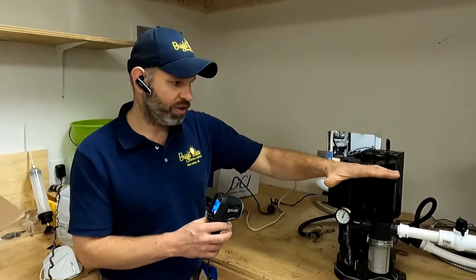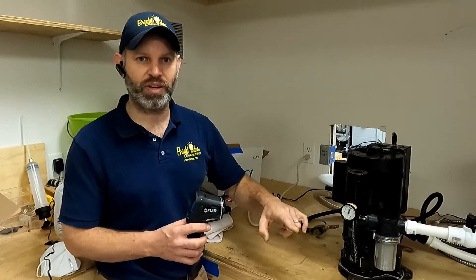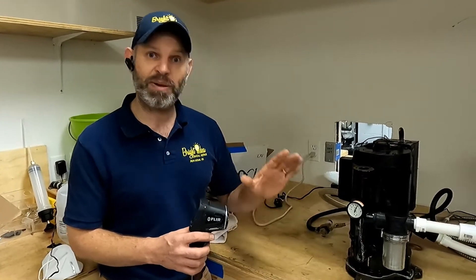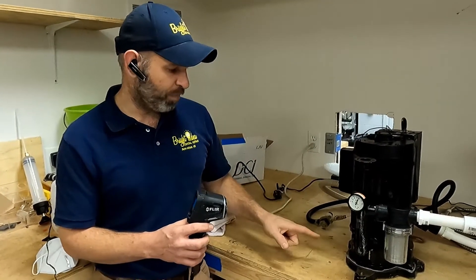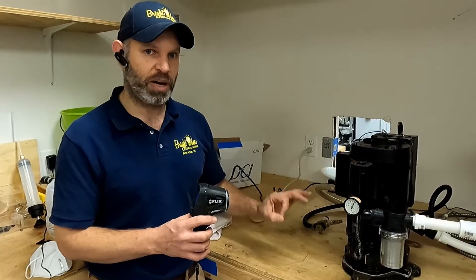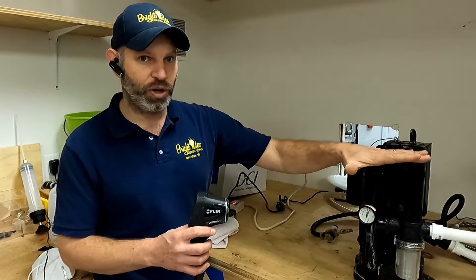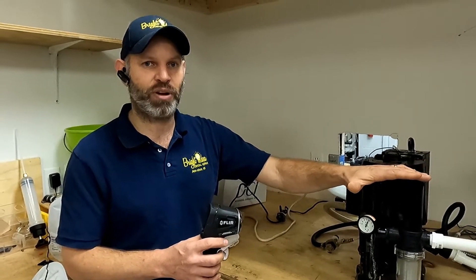The key takeaway here is that the health of a vacuum pump isn't simply how much suction you get toward the operatories — it's also how much strength is left over to pull air in through your vacuum relief valve to actually cool the pump housing itself. If your pump is old and tired, it might be possible to max it out so you do get the suction you need to your operatories, but this pump right here is not going to last very long. Just because a pump is pulling doesn't mean it's healthy — it might be on the verge of dying, and you have the ability to help your customer know it's time to act prior to a catastrophic failure.